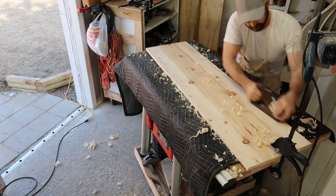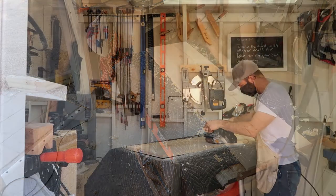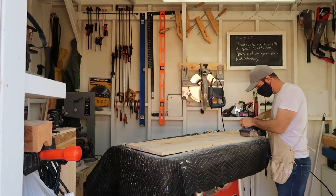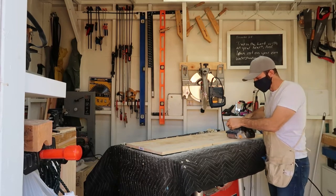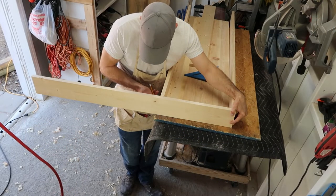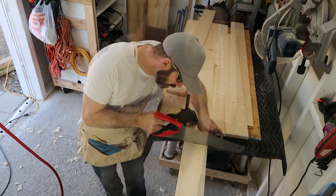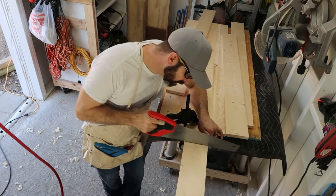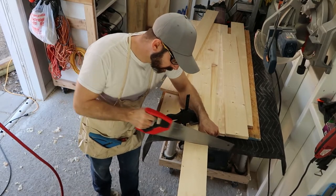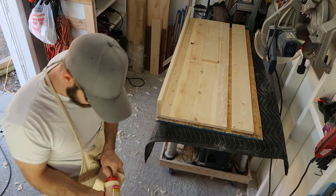You should sand it — that's a good idea. You could have just sanded down the glue if it was nice and flat, but sometimes when he sands he goes in circles instead of back and forth, and it drives me crazy. Now he's putting on my favorite part — this is the edging, it's kind of like the frame around the seat, and it's absolutely beautiful. These are four and a half inch boards. When you go to Home Depot they have a big stack, so you pick through and find the ones with the character you want, because you're gonna be looking at it.